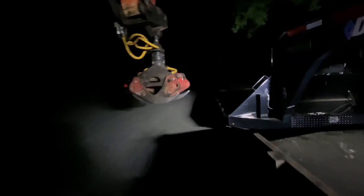The 080 is pretty much the main machine we use — it goes on every job, it's always needed. So to have this thing back in full tilt — I remember the first time I ran this machine and thought, dang, the blade is super quick. The last two or three jobs it just got super sluggish, the blade and the slewing rotation power really died out. But just running it for a minute it felt like the old machine, so that new pump really did it. I'm sure the new filters weren't a bad idea either. Hopefully you guys enjoyed it — it's late, I'm kind of tired. Stay busy out there, whatever you're after — your goals — just keep up with it. Chances are nobody's gonna give you everything you want, you're going to have to go work for it, and there's good honor in that. We'll see you guys later.